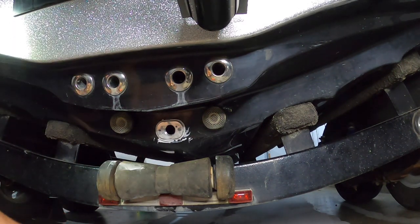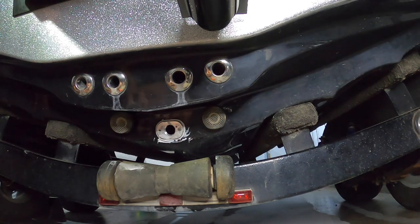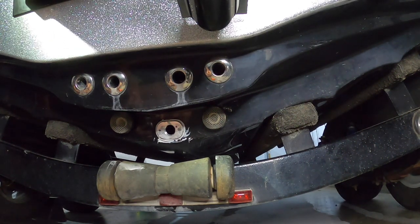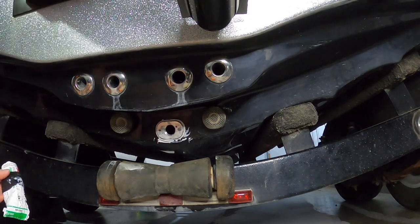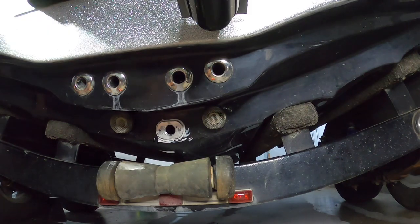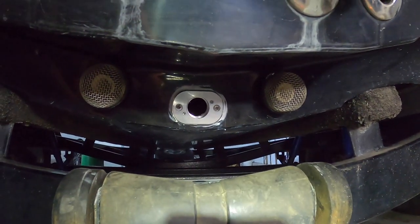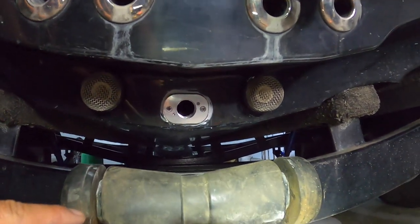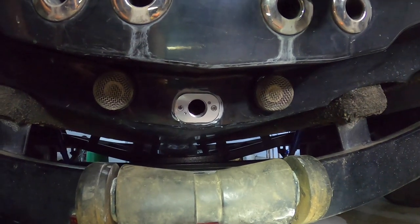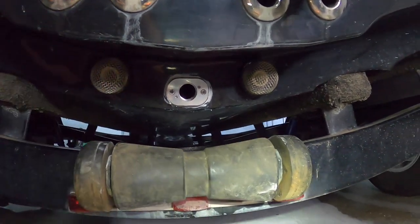It takes like 24 hours for this to set up totally before you're really supposed to put it in the water, so it's not super urgent. It's not something that's going to set up very quickly on you, but it does start to get a little tacky after a while. We got all the big stuff off — I'm going to come back and clean this up once it dries with the razor blade and get the rest off the gel coat. We will move on to the next part, which is going to be feeding the cable through here and putting on the actual plastic components of the remote drain plug.